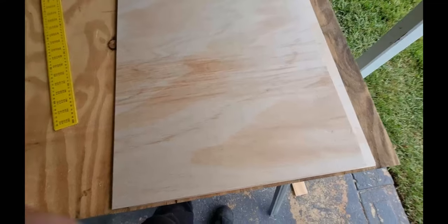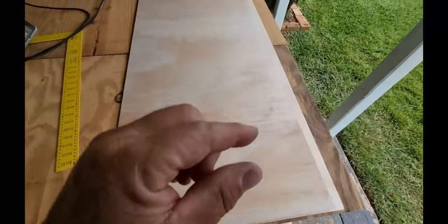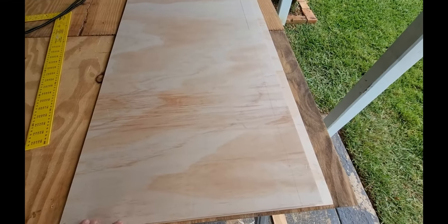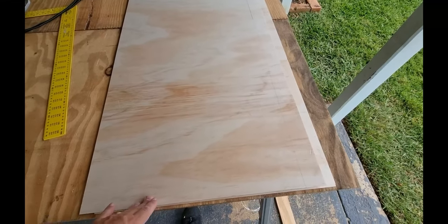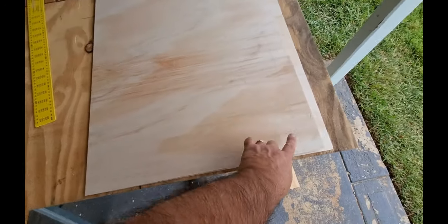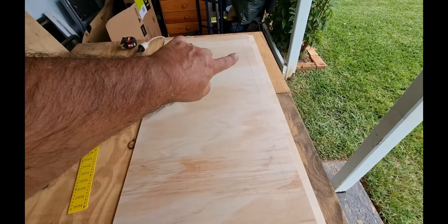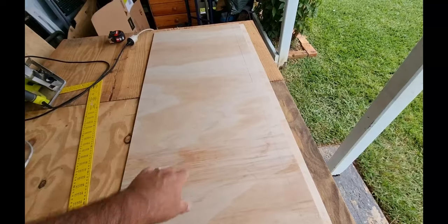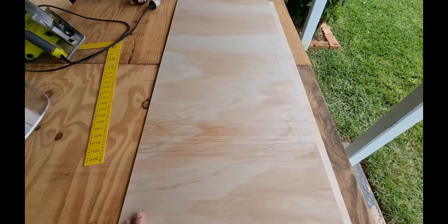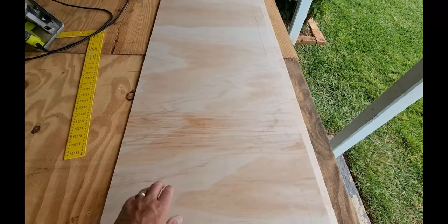With the cabinets I'm putting a 3mm bit of ply underneath just to lift it up off the ground to give me extra coverage for the flooring when it goes in so the drawers don't hit. I'm measuring out the toe kicks - they are 490 wide by 1886 long. I'm cutting one down then cutting half of another one down and this will lay straight on the floor of the bus and then the cabinet toe kicks and drawers will sit on this.